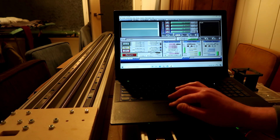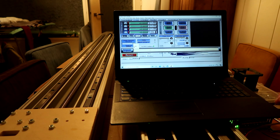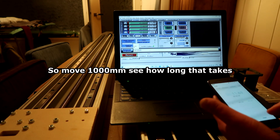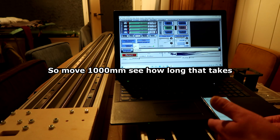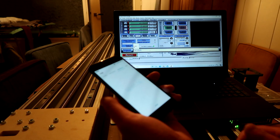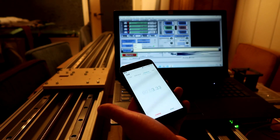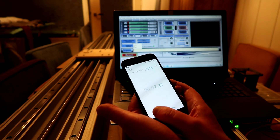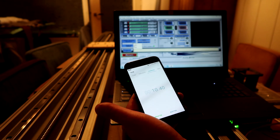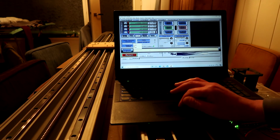We're gonna check that because it's kind of weird — normally this is correct. What we're gonna do, and it's really low tech: we're gonna say move one meter and I'm gonna start a timer. Most professional method of doing this, but I just want to be clear — Mach3 is messing up. 10 seconds and 40... 10.4 seconds. That is 6000 millimeters a minute. So Mach3 is certainly not displaying the correct feed rate.